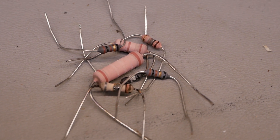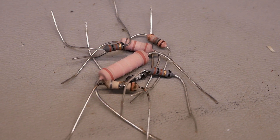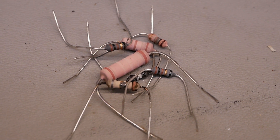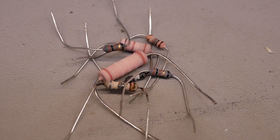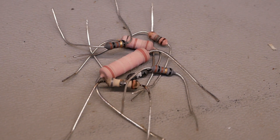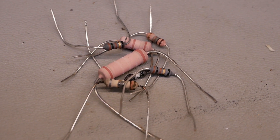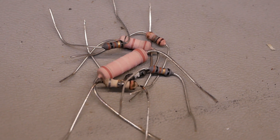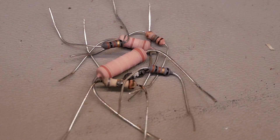You can see here how reading an overloaded resistor's colour bands would be pretty difficult. Sometimes you have to either find documentation online as to what was originally in there, or look at the circuit and determine what was the likely value if it's a little building block of a circuit that's easily recognisable. If it's not easily recognisable, you might have to do some trial and error to see if the voltages will be about what are expected - because you can't measure them, they're open circuit.